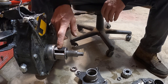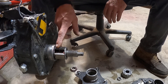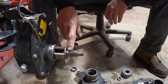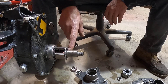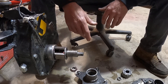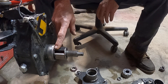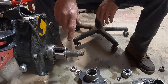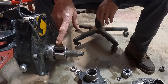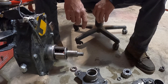With this design you can just use grease instead of an oil bath. The downsides are there's no engine braking and there's no reverse — it won't drive these wheels in reverse. There could be some type of lockout mechanism added if you really want reverse, depending on your application. There's also no electromagnet to deal with; those are a little finicky in their adjustment. The downside is you can't turn this on and off — it's always on. Alright everyone, thanks for watching and go out and get building!